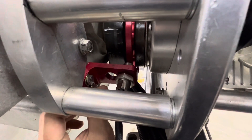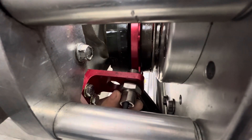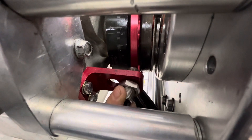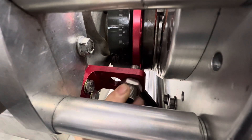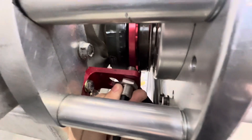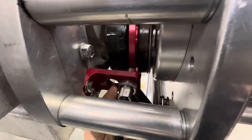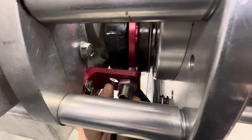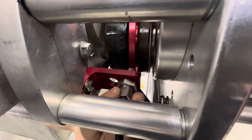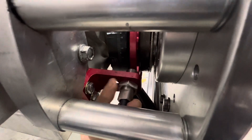So as I mentioned, you just get in there — and this one's really hard to get to. So it'd be really difficult to do feeler gauges and that kind of crap. You just go in until the trigger touches the wheel. All right, and note the position — you've got a flat on top. So we'll come back one half turn, one full turn, and lock the nut down right there.